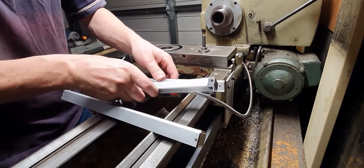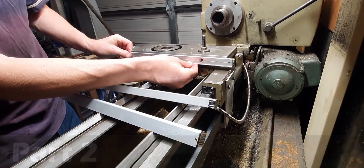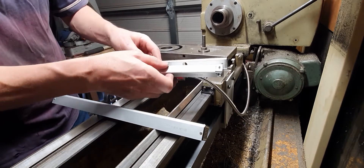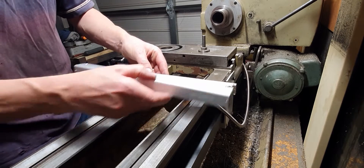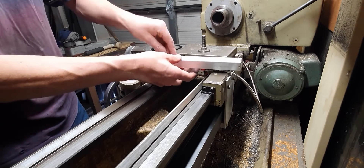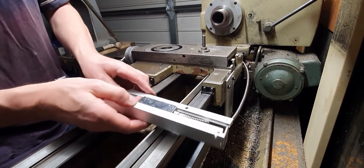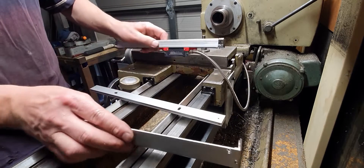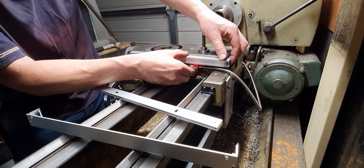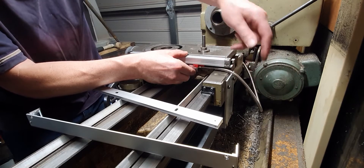This is the makeup of the cross slide. We've got a bracket which is going to screw on the side here - we need to get that height right - and then the scale sits on and screws to that bracket, and then the cover will screw over the top. The reason I got the slimline scale was I needed enough room to fit the scale approximately around about there, but still have the cable able to move in and out freely.